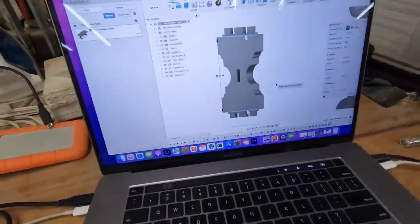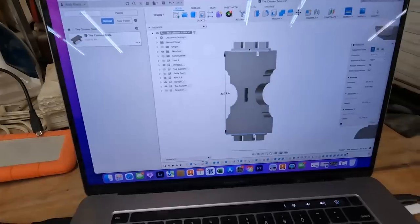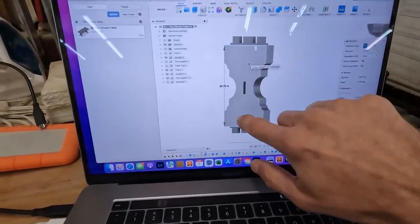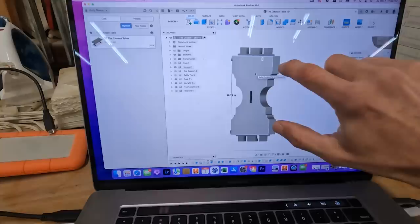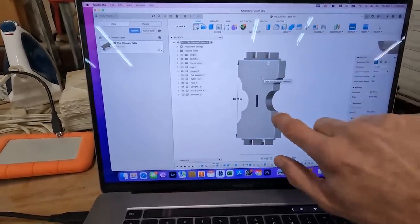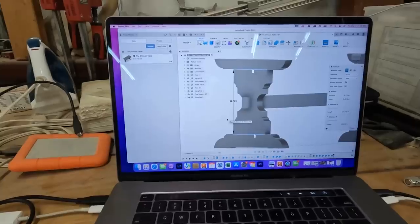So here's a look at the CAD drawing in Fusion 360. This is the upright. You got the tenons up here. What we can do is just skin from shoulder to shoulder, so this will save some yield on our materials. These are 2-inch tenons, so we don't need to worry about adding 4 inches to the live oak because that's in the core material. So we're just going to focus on cutting veneers to fit this face. The foot right here is going to get veneered, both faces and the upright. So that is what we're going to start working on.